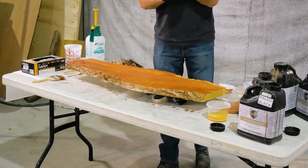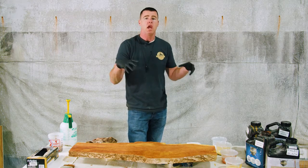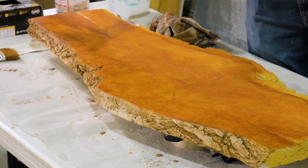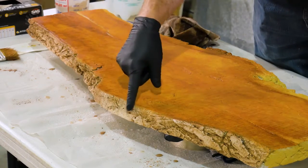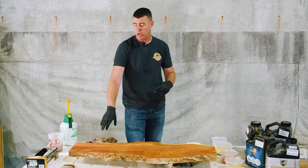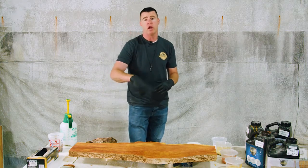There are a couple of pictures on Trinix's Facebook page where we did those planters with a crackle finish — worked out really nice. The crackle texture has those deep recesses that allow pigment to settle to the low-lying areas. This piece is pretty much dry. There's an area here in the mold where the bark has been removed — that's going to show more of that honey tone, the warm undertone we applied on the base coat when we started this process.